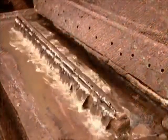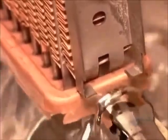After straightening out any crooked tubes, workers dip the headers in a tank of hot liquid lead for 30 seconds. This solders them to the sides of the radiator.